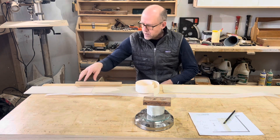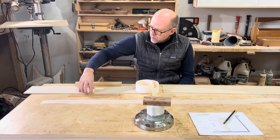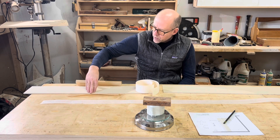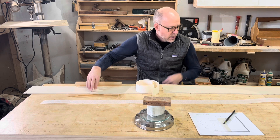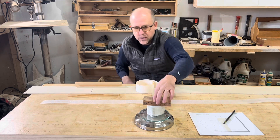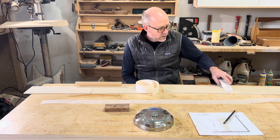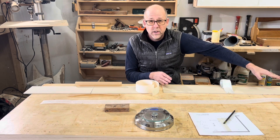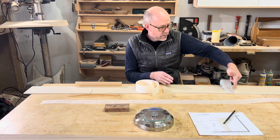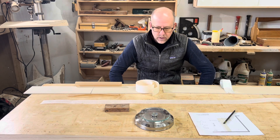All right, so I have these panels. I'm going to glue a piece of tape across this joint. The paper is going to be held with TiteBond III and the fiberglass is going to be held with epoxy. Then I'm going to do a strength test — I'm going to cantilever this off my workbench and put some weight on it, keep adding weight until this breaks. I think that should be a good test.